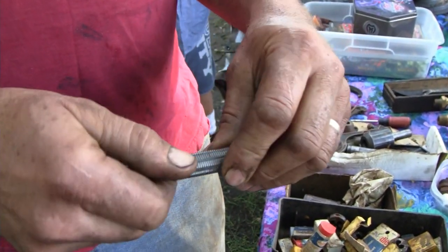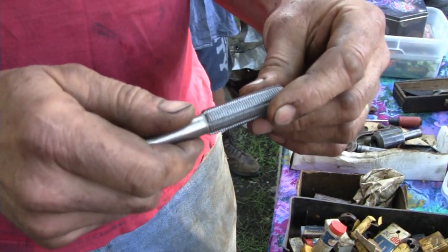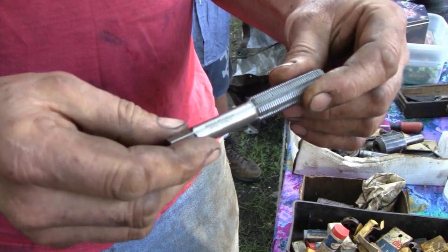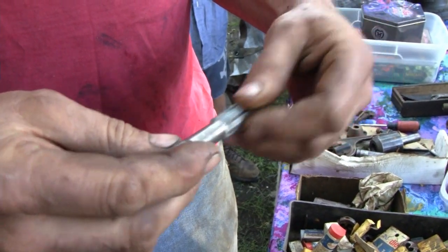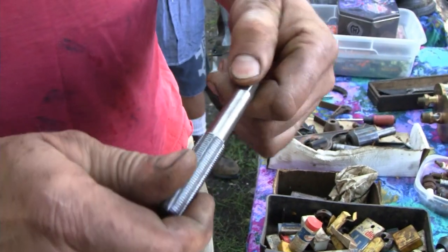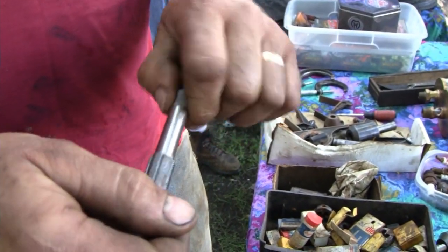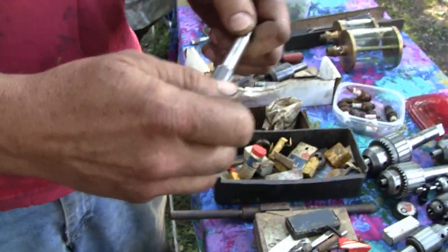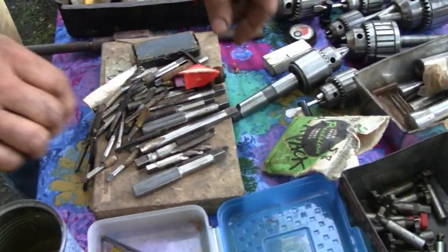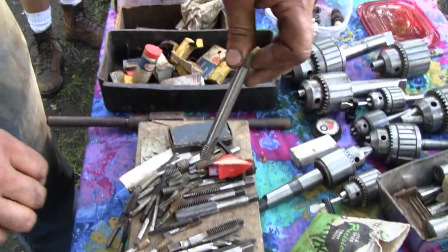So this is good for blind holes — you don't want to pack chips in the bottom in production. I used to use them in copper because copper is really crappy to cut. They're quite expensive, but they came along in some surplus stuff. Road King's going to have an assortment of odd taps. I'm going to put that in the drawer of tools I'm never going to use. I got a few drawers like that too.